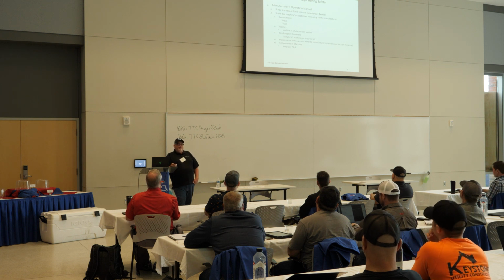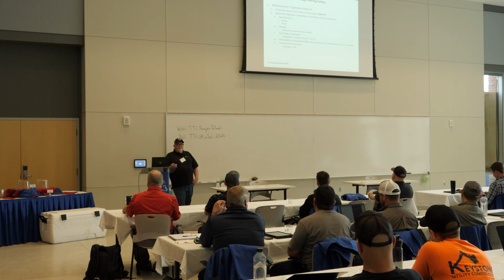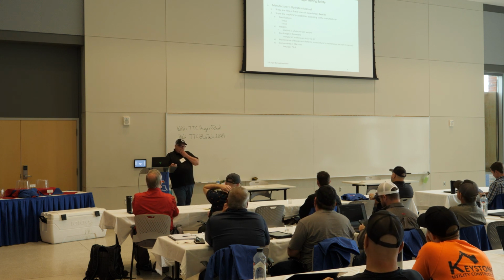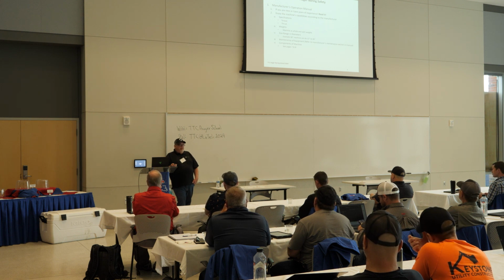Again, I stress the manuals. It doesn't matter if you got 2 years or 20 years. Every machine's got a little bit of difference in specs and stuff, so just be aware of it. Know the range of your machines too. I trained a guy, he had 15 years under his belt. He left the head on, and left the new feathers on, and was killed. Machine flipped and smashed him twice in the ground.